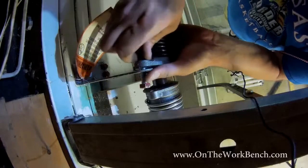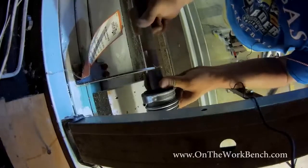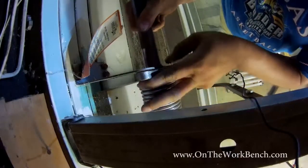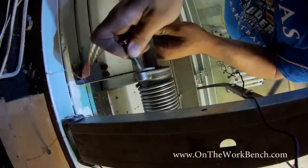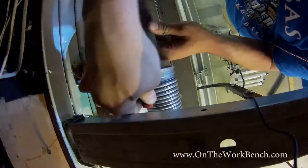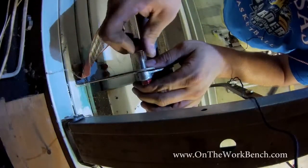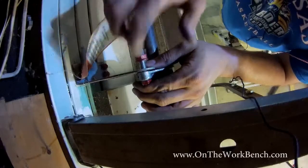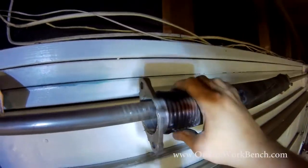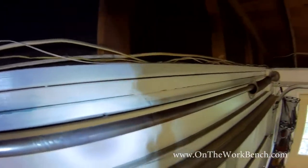Reminding that I've got to be able to remove the spring on the other side. So we'll slide that off. But we still want this torsion rod supported. So I'm going to take my combination just like that, so the rod is still supported. And now that frees the spring on the right side, which is the left wound spring. And then now I'm going to slide that down to the end.